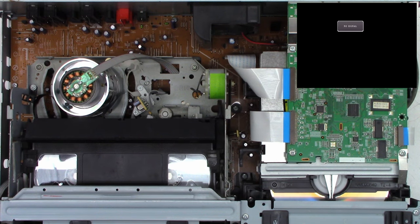And I think this thing just has a little bit of bearing wobble. It's most likely not ball bearings, but sleeve bearings. So I'm probably going to try to find a couple of these on the Jungle website or eBay, I'm not sure, just to have them in stock for future use. But yeah, this is the noisy one. Of course, it sounds good now because I've been messing with it. But anyhow, there is the new fan installed.